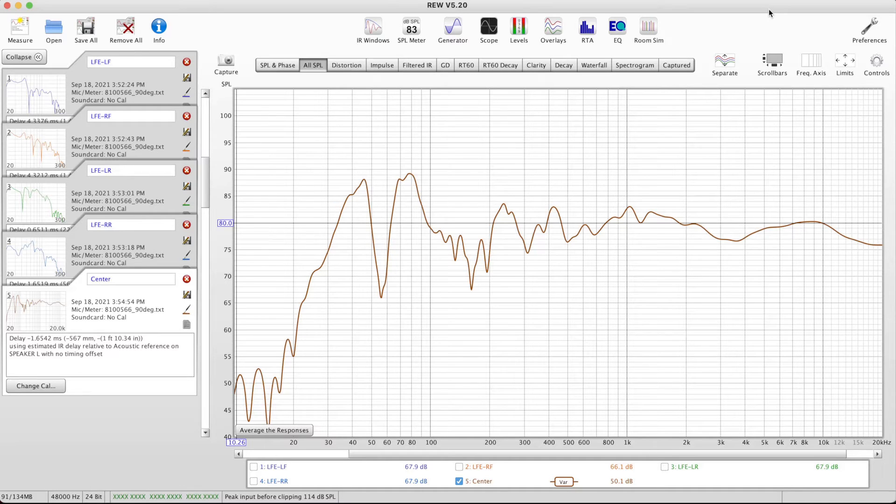You'll sometimes see Austin Jerry over on AVS Forum talk about just sweeping the center and disconnecting the cable, which is fine. The problem on mine is that it requires a crossover to be set, and I want to see the natural responses of the speakers without any crossovers in place, so I'm going to move that cable.